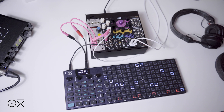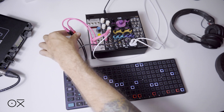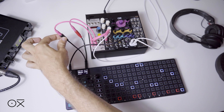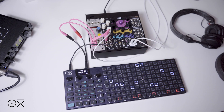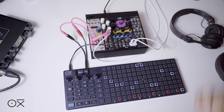To input two signals into the clock CV in, we will need a white TRS cable like this one, which allows us to input the clock signal through the tip and the start-stop reset through the ring. We will connect our clock source — black in this case — to channel 1 on Pamela's, and the start-stop signal into the red, the ring, into Pamela's output number 2.